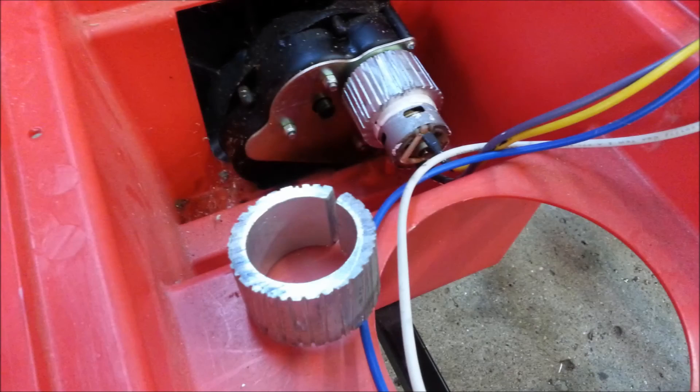And finally, our heat sink mods. I'm using some quarter-inch thick-walled aluminum tubing with a full slot cut through one side to allow the motor power wires to slide through, and then some more vertical slots cut in there to increase the surface area. I use some thermal compound between the motor and the heat sink to increase the thermal conductivity. Thanks for watching this video.